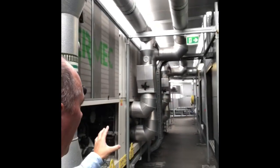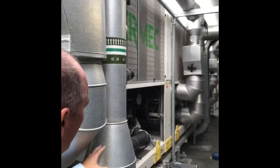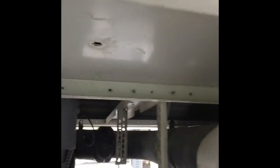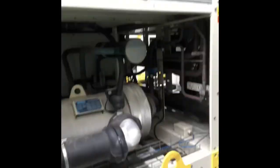These are the inverter screw compressors — very, very reliable. They also have free cooling, so I'll bring you around to the far side to show you the free cooling connections. We have a common header running down the side. These are three-circuit, three screw compressors, inverter screw, and we're teed off to each evaporator. Water comes in, comes down, and goes into a three-port valve — if the ambient temperature is low enough to provide free cooling, the water goes down through the free cooling coils, gets cooled, and comes back around.